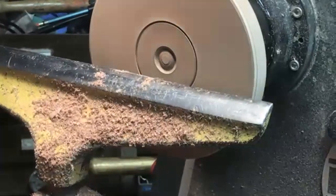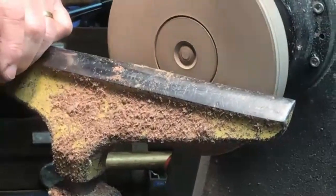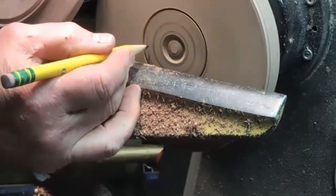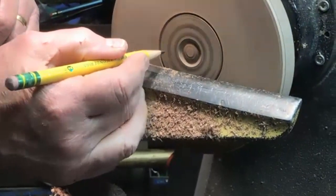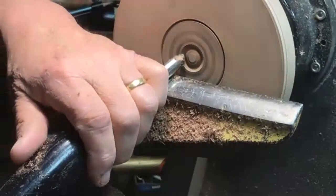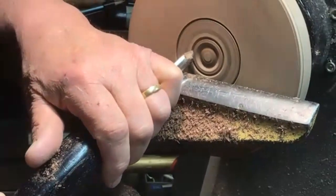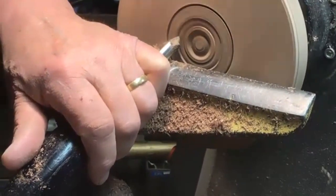I'll hold that where I can see it. Actually I should take a pencil and mark these out: the first one is going to be about that big, the second one about that big, and the third one I can always cut down. Here comes that shear cut again - I roll it over and want to end up right on the end of that mark. I'm going to come out, drop the handle, roll - cutting down the left-hand side of the flute, then piercing back in toward the line.